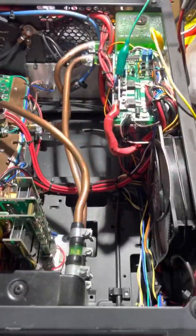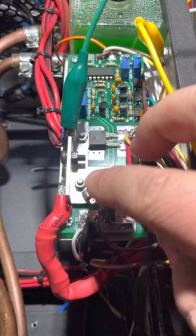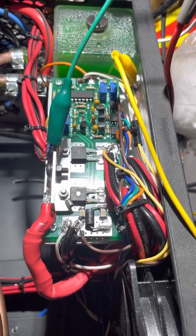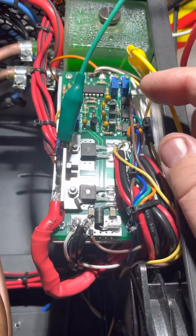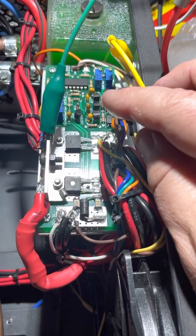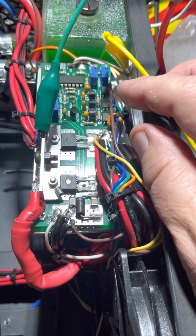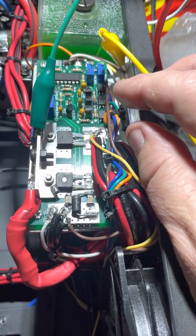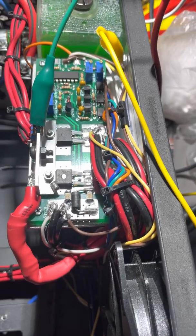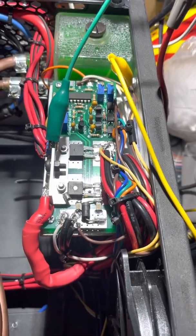Okay, so I'll just give you a quick rundown. That's our current protect board. These two devices shut the 50 volts off in less than a heartbeat — it's really, really quick. It senses SWR to the filter, SWR to the antenna, and over current. You can set the current limit; if the amp tries to use more, it will go into protect. You could be banging away at 2,400 watts, pull the coax out, and it instantly goes into protect.